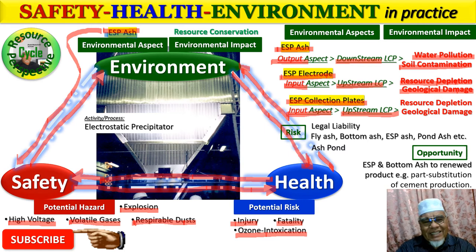Here we are discussing coal-fired power plants. See, the demand for coal is very high. And occasionally you have other small, less than 1% composition of minerals in the carbon steel. It can have manganese, maybe 1%, or perhaps 0.5 to 0.7% silicon, and perhaps some percentage of copper that constitutes what we call carbon steel. And the more demand for carbon steel means the more demand for resources, thereby imposing an environmental impact known as resource depletion, and also mining that would distort, damage, and interrupt the geological structures.